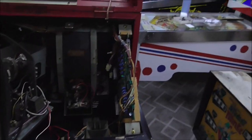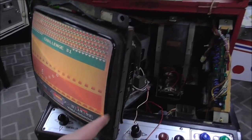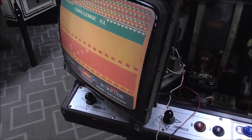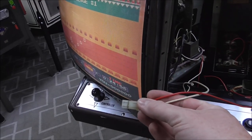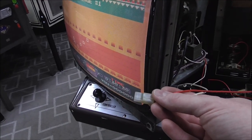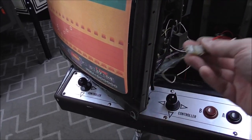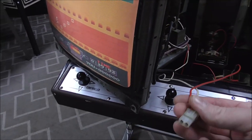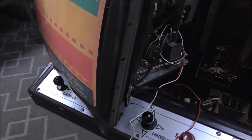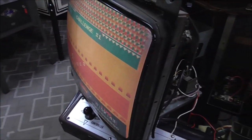But this monitor's sound doesn't work. Joe did a cap kit and it looks good, so we've got two monitors that look good visually. But the sound doesn't work on one, and one half of the game board still doesn't work — so you only get video on one monitor. I'm going to pull the monitor out and track down the audio problem. The speaker checked out at about eight ohms resistance, and everything looks like it's plugged in right, but we don't have any audio.